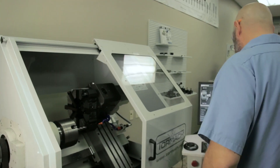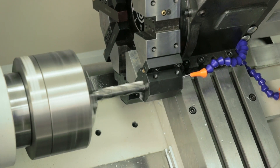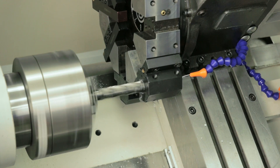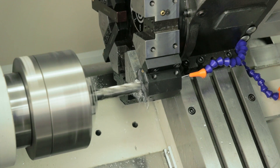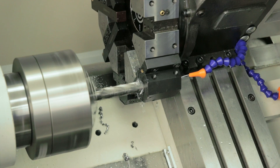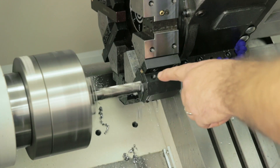It's time to start machining. A little bit slower — see, that sounds better. Now I'm just jogging in with the feed wheel, jogging in a ways, doing a little back feed just to break the chip. That's the sound of us going through the set screw hole.